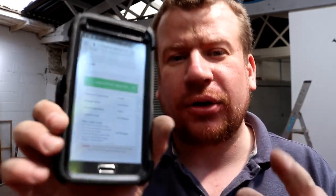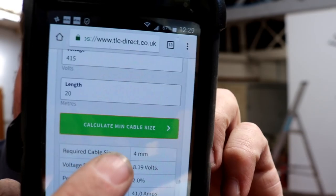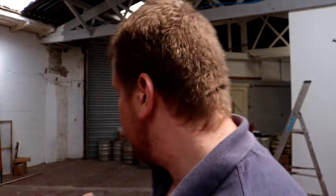The boil kettle is going to have two 9kW elements in there which will give us 18kW draw, and according to this calculator on the internet - we'll try and get this in focus for you - the calculator says that I can use 4mm square cable to carry 18kW of power, which would be 41 amps, if the cable is clipped direct to a wall, steel wire armoured four core, which is what we've got. We've got a 20-metre run, so I'm quite pleased with that. I think we'll be able to stick this up and not have any concerns about it working. Let's go ahead and figure out where we're going to run it.